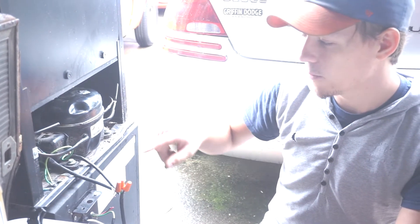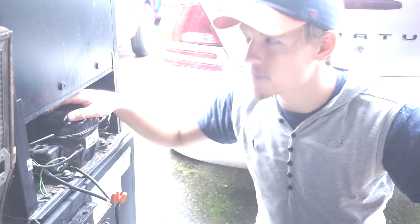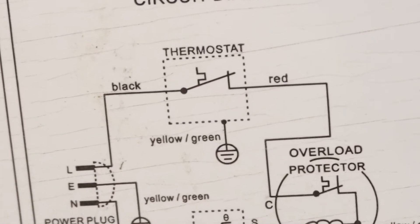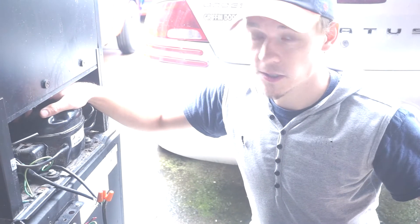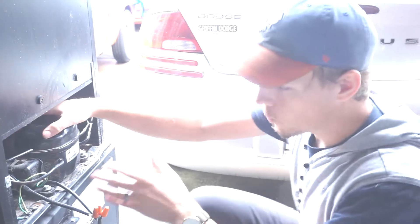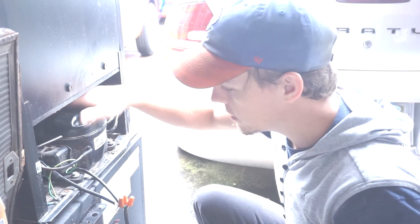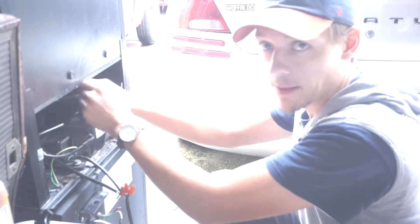Through trying to figure out why this compressor wasn't starting, I had it directly wired into the compressor itself. I thought maybe the thermostat would be some sort of resistor — a potentiometer of sorts — because there is a lovely schematic on the back of the fridge. I'll include a picture here. And it looks like a switch. Its symbol is a switch. But I thought potentially this was a potentiometer. So then, warily, I wired the mains voltage into the compressor itself, and it is running. It is nice and warm. It's very cold today, so I'm warming my hands on this.